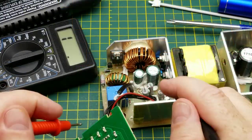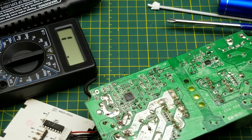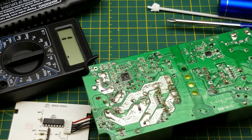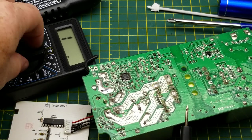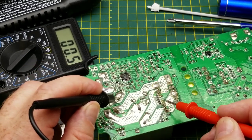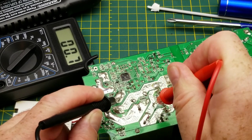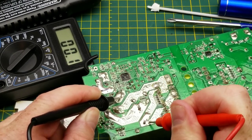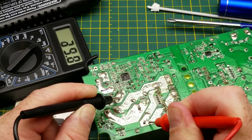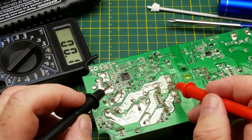Measuring the voltages on the low-voltage side — even though we know the output isn't right because it's just a super-low duty cycle and can't provide enough power, the two output diodes are in common cathode configuration. They're not capable of sustaining a proper voltage, but the rail does spike up to 35 volts occasionally — it's just not getting enough input to hold it up.